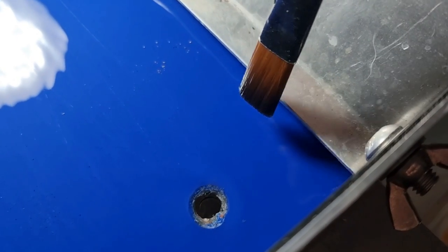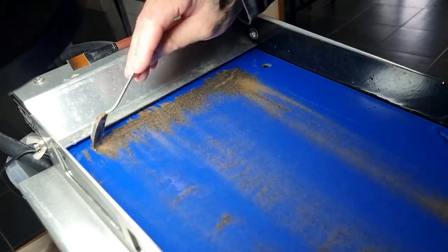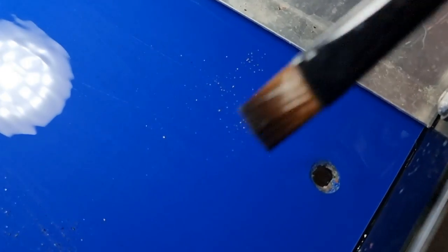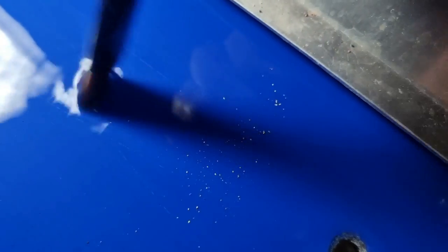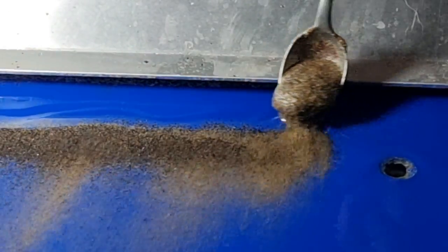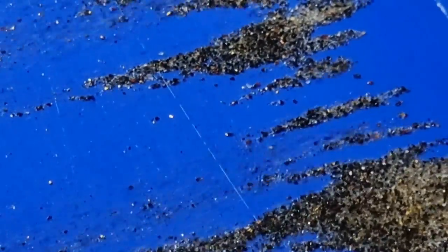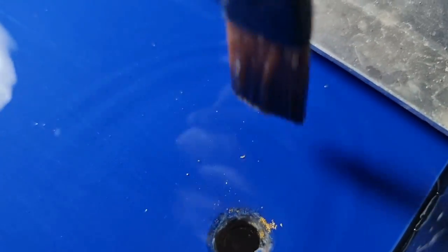From that one teaspoon — if you have a miller table, 60-grit sandpaper the whole thing, except for the top inch. From that point up I've got no scratches; I've left the bed smooth so I can dump my concentrates along it and all the black sand shifts forward. The scratches are only there to stop the gold that's going to roll. All gold prospecting equipment loses gold — it's up to you to modify it to make sure it works for your ground. This is four teaspoons of concentrate. I'm not surprised about the type of gold; it's all really round, with that shape that doesn't like sitting in laminar flow without obstruction. But I'm surprised about the quantity. The willingness to experiment with your equipment and the openness to admit that you may have made mistakes is what ultimately makes you a better gold prospector. Sometimes the most simple modifications to a piece of equipment can have a massive overall impact on your total gold take.